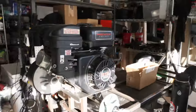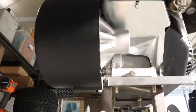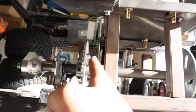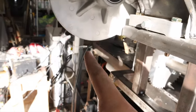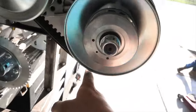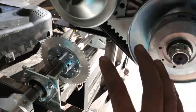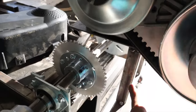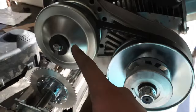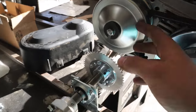I'm liking the way this is looking — I've got a decent amount of adjustability. Now I need to cut the CVT guard so I have a chain. I got the cover off, and I realized I can bring it down actually quite a ways so that I don't have such a long chain — that's what the setup is on my cooler. You just bring it right down close to it and then you've got a super short chain that doesn't wobble. So I'm going to take this off and take these bolts out and move it this way.